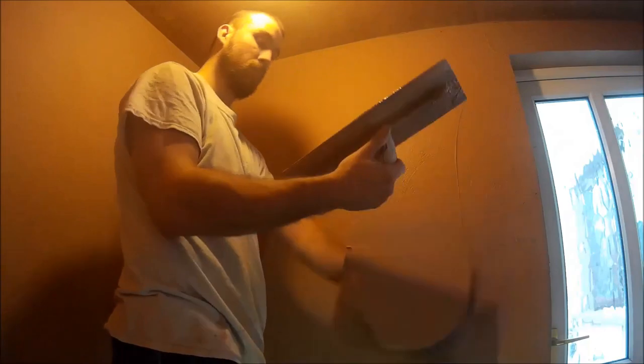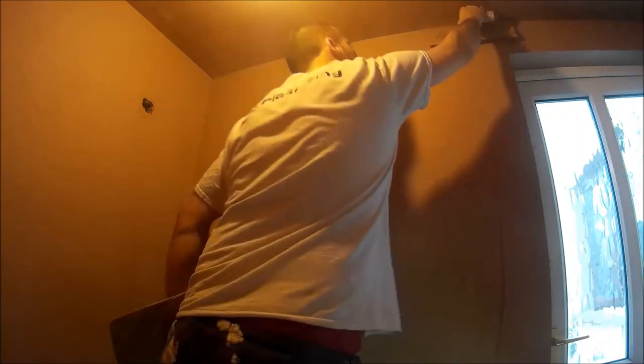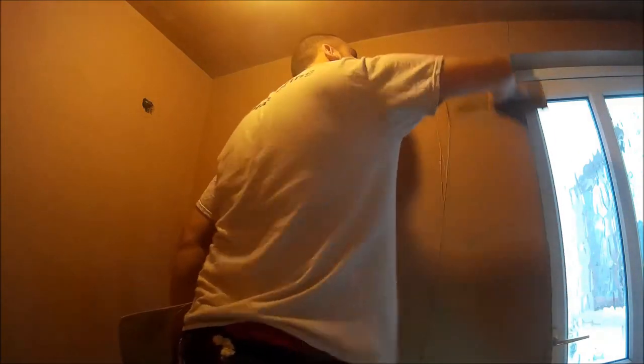My advice is to get it filled out as much as you can on your first pass. That makes your second coat less heavy so it won't slump and slide, and gives your first coat time to pull in and tighten. I do like doing wet angles — on certain jobs they're very beneficial for speed. If you're a beginner, wet angles might be trickier. You can do them with or without an angle trowel, but an angle trowel definitely speeds you up.